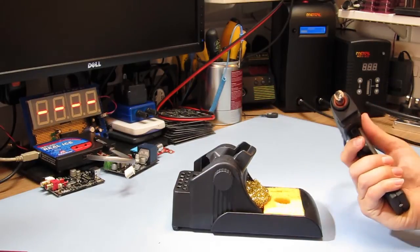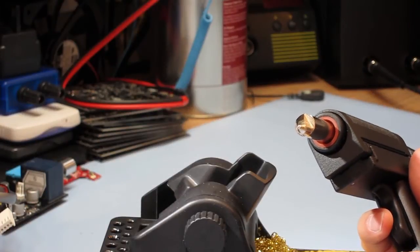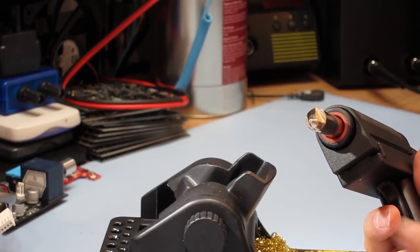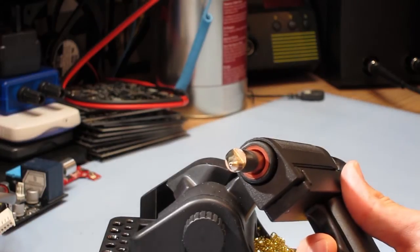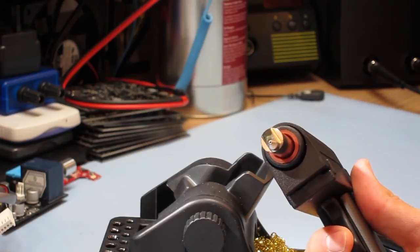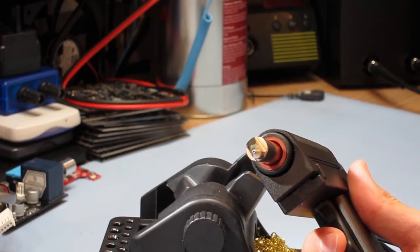It's sitting there at 30% now and I can just see the solder starting to melt on the tip. It's just starting to melt now and if I tap the trigger, the solder should be sucked out from the centre of the tip. I think that shows up on camera — there's a hole now there. I think this is a 0.7mm tip. I haven't got any big ones at the moment so I'm limited to what I can have a go at desoldering, but we'll give it a go.